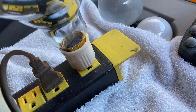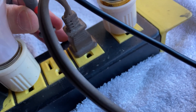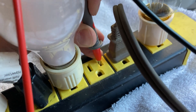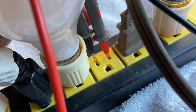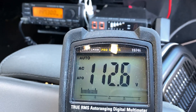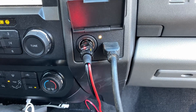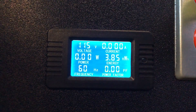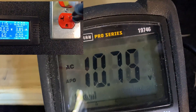I normally skip showing the setup in each video because I really just do this to check the polarity on the inverters and make sure I don't hook my scope up to ground or a hot line. But this time I needed to show it. All this is: coming out of the inverter, going through the meter to the surge strip, and then I'm taking the measurement.